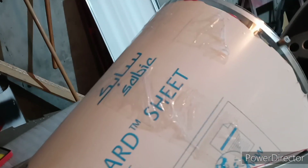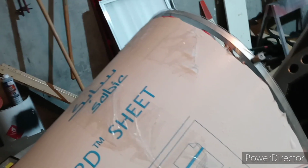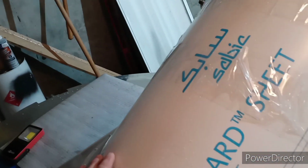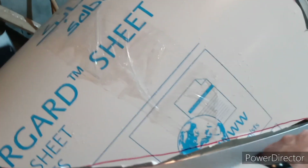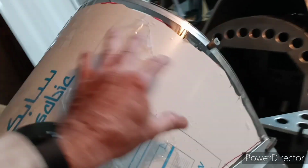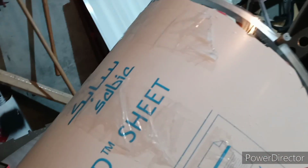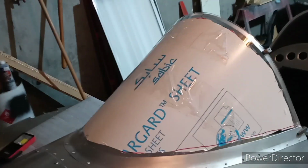And I guess, of course, they say this Lexan doesn't crack, but it does get haze marks in there from being bent around here, and I guess the sun and all that. But on my first Ultra Cruiser, I put black silicone in there after I already went around and drilled all my holes, got it all ready to go in, and then I shot some black silicone in there, and then shoved the windshield into it, and then shot my rivets, and that was it. And it was good.